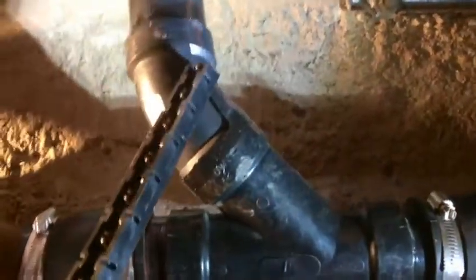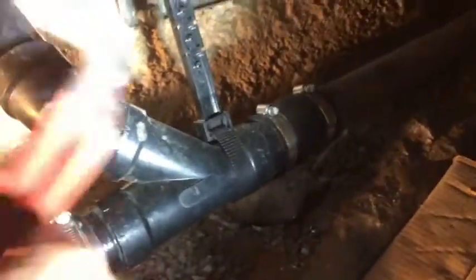The last thing we're going to do down here is support this with a pipe hanger. Where the joist is, it works out best to put it right here. These rigid pipe hangers are nice because they support the pipe not just from sagging but also from pushing up — so it's really good support. I just cut this little piece off and it's nice and tight. It attaches with two nails.